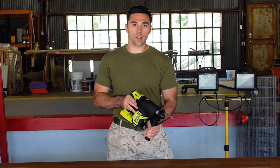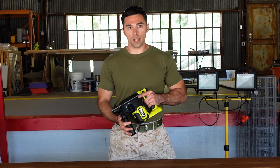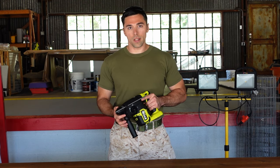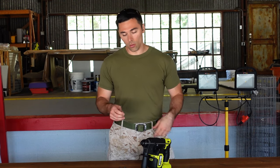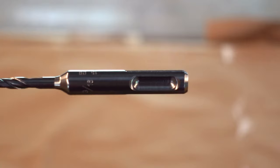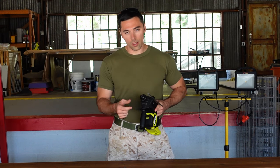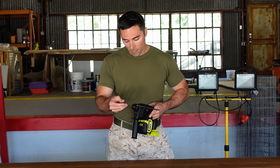So these tools can become very expensive, but it's just based off of what you're trying to accomplish. Even though this Ryobi is on the cheaper end of the spectrum for rotary hammers, it still comes with a lot of capabilities. First off, this rotary hammer takes SDS Plus chuck bits. The bottom of the bit has actual grooves cut into it, which allows it to quickly drop into place in the rotary hammer. So instead of having to loosen a chuck and then screw it back down, you're able to just stick it in and it locks in place.